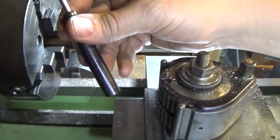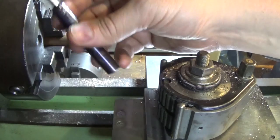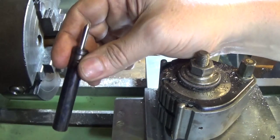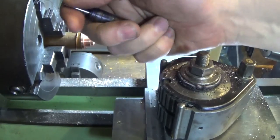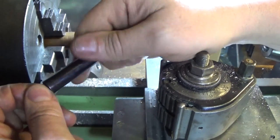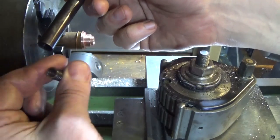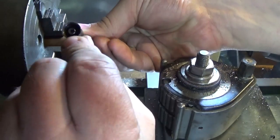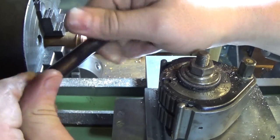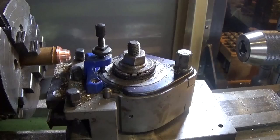This is made by Phil Desjardins in Canada and Pierre Beaudry. They made quite a lot of these and I was given this at the summer bash. It's a beautiful tool - all hardened and ground and lapped, with a really pretty texture and a cap screw in there. It's reversible: unscrew that, slip the spring out, and it's got a hollow in the other end so if you turn it round you can use a tap with a point on it. What a great thing - a beautiful tool. Thanks guys for thinking of me.